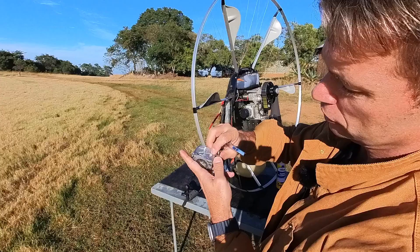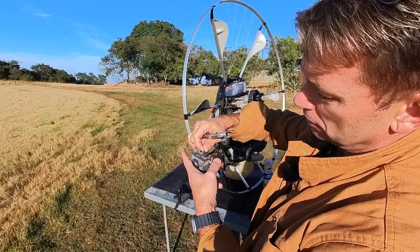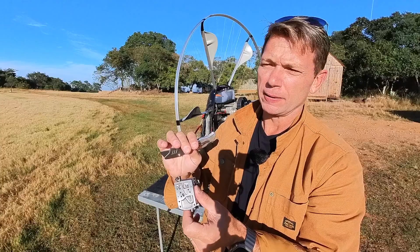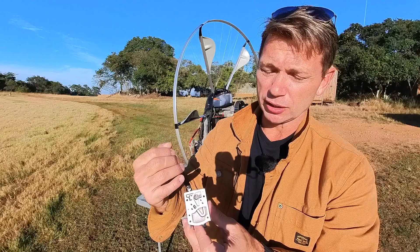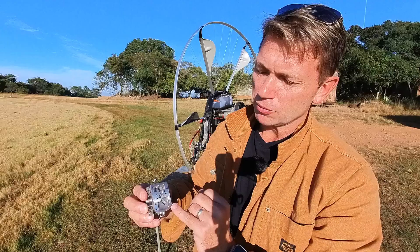When you reinstall the sieve, you just push it back into place and use the knife very gently — not poking any holes in it — just to get it into position. There's no glue or anything used to secure the sieve; it literally just gets pushed in. That's the part of the carburetor that'll get jammed up with dirt — it's the first point where fuel comes through from the fuel tank and is most likely to get clogged with debris that's passed through your filter.